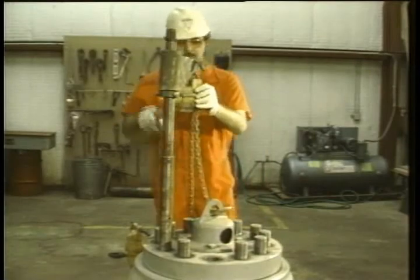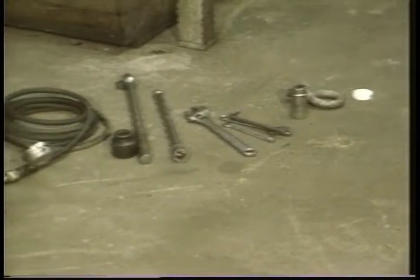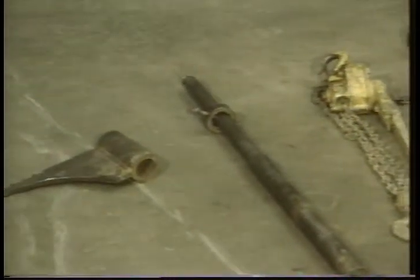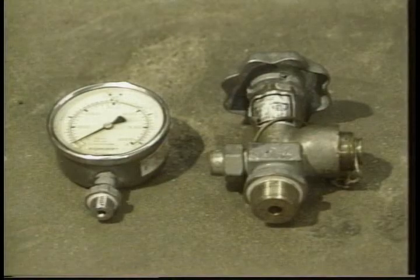Now you'll have to remove the head off the dampener. Have your tools ready, like an impact wrench, open-end wrench, socket set with extensions, and so on. Also, have a new diaphragm and valve and gauge set on hand. You'll probably have to replace them all.